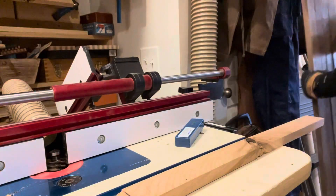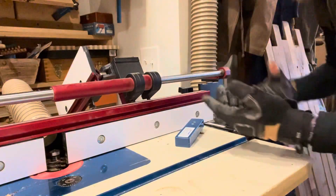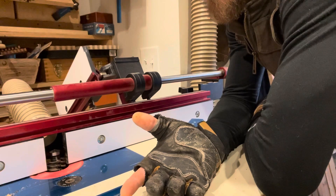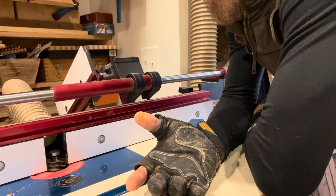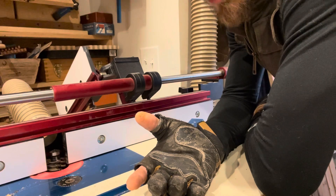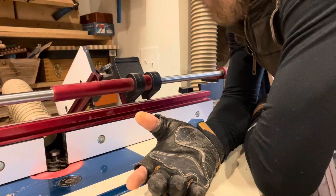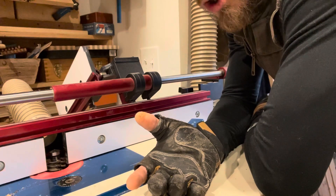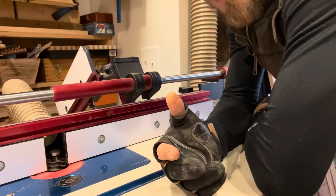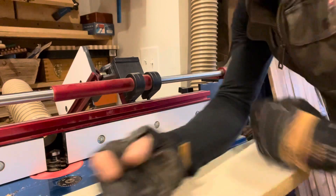If you have questions, please ask — it really is that simple. You might not get it on your first shot, but if you make yourself a template you can keep it. However, when you run a planer, unless you have true accurate stops, not every board comes out the same thickness. So if that one thirty-second or one sixty-fourth is a deal breaker for you, definitely make yourself a template and make sure it matches your appropriate thickness that you're running through your planer. Thanks for watching — I hope you learned something. Please like it if you like it, hit subscribe if you want to see more. I try to keep this stuff very simple. Everyone have a great day!